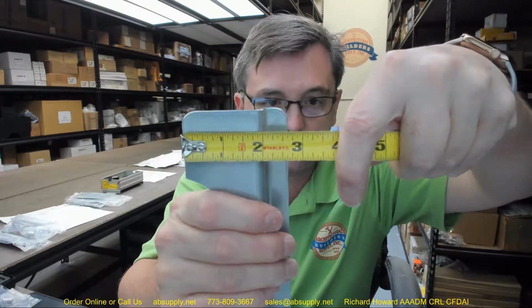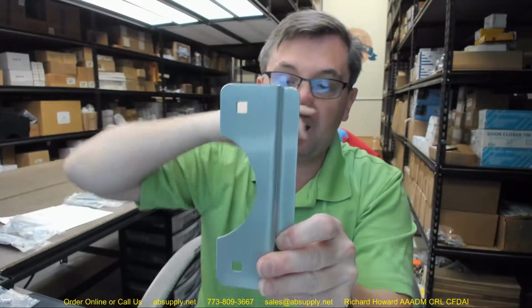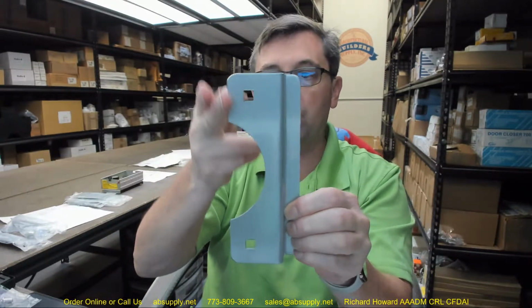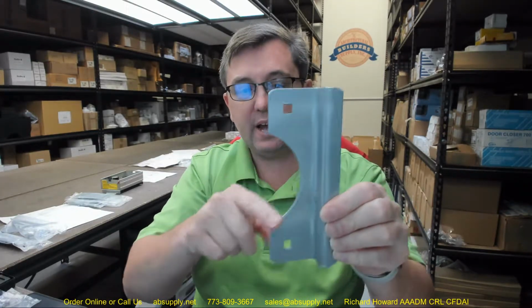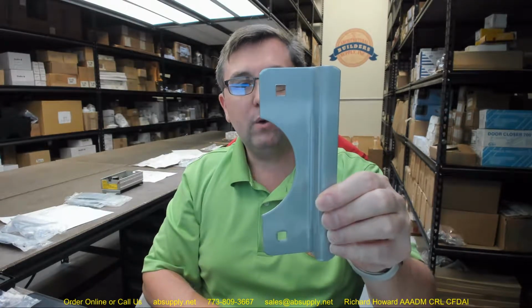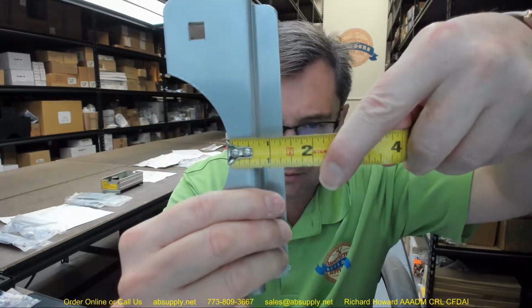What we didn't measure earlier, you've got about 2 inch of the latch guard itself before it will make that bend. So now you can put yourself in a relationship of where this needs to be in relationship to the edge of the door compared to where you'll fall here. This is a 1 5/16 radius, so that's going to have a 2 5/8 diameter. What that means is you're going to be able to accommodate grade 1, grade 2 lever rose trim. That's a large prep on that sort of door on this latch protector, so be mindful you'll be able to handle that quite well.